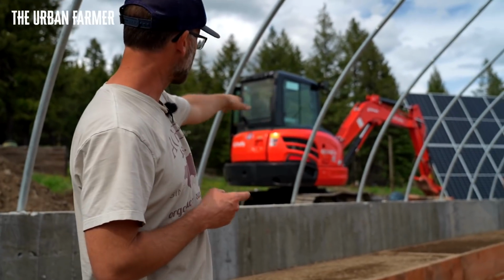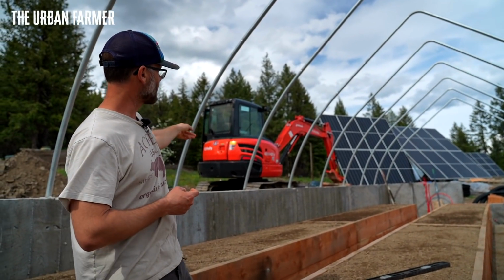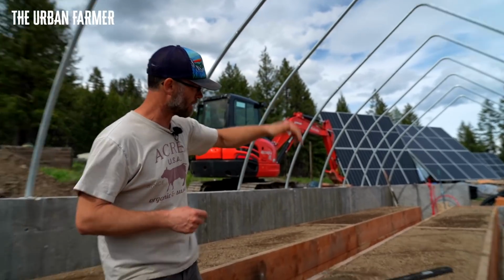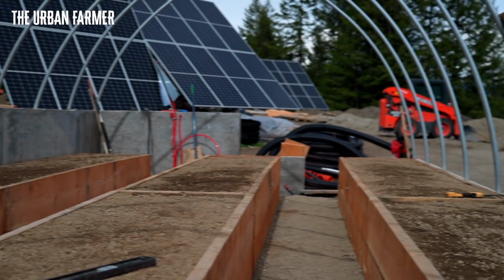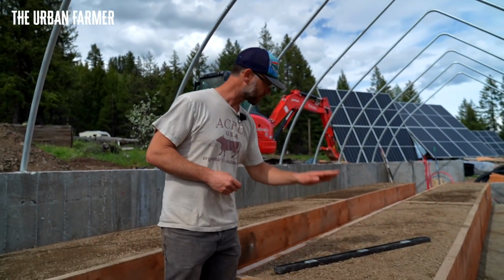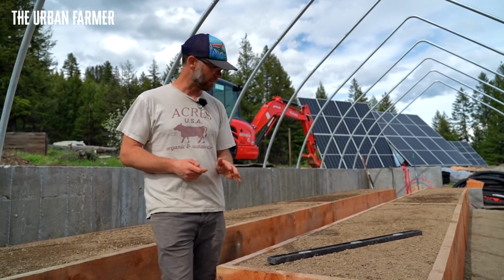So bringing the skid steer all the way around, I've built a ramp where the mini excavator is right now, and the skid steer would come and drop the pile, and then the Mini X would come over the back, and it would grab with the cleanup bucket, grab the soil and dump it into the beds. And so that was more than a day's work to do all that. And kind of what I did was, when I had the soil in the beds, there's a couple things I would do afterwards. So I would fill the beds to about 80 or 90%.